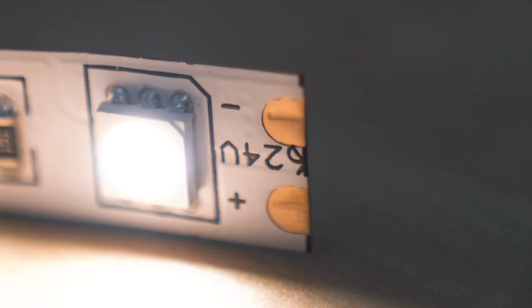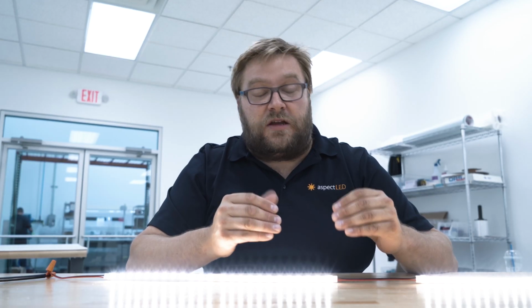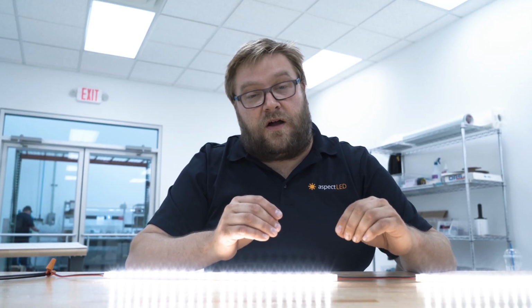It's important to note that this is a quick connector. Soldering is going to give you a more permanent and long-term installation. It's also important to note the polarity of the strips. You have to make sure everything is on the positive or negative side and that the wires all match. You want to make sure that you're getting the door on the back side closed all the way.